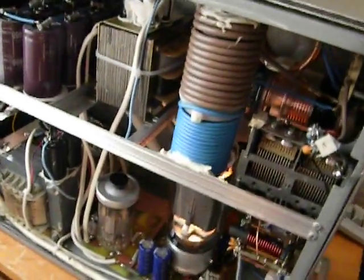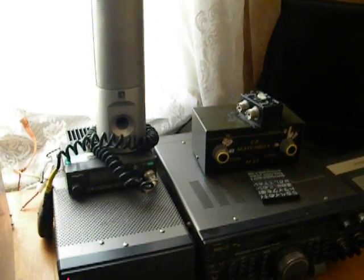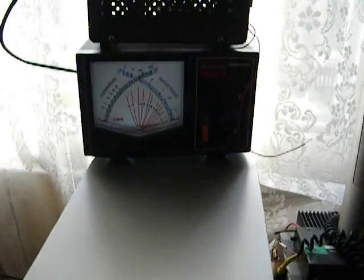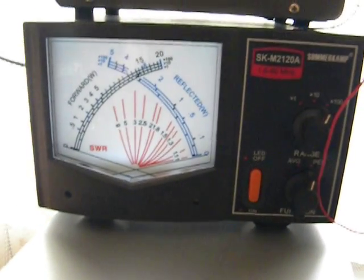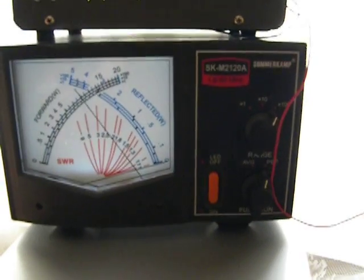Another improvement was to build all the walls of the case in aluminium. Iron wasn't okay because it started to vibrate when the amplifier was put into transmission mode, so now everything is aluminium. I think it should be heated by now. I'm starting the anode voltage and trying to see the power. Now we are on the 2 kW scale — passing into transmitting mode, let's see.